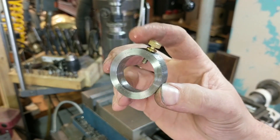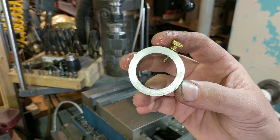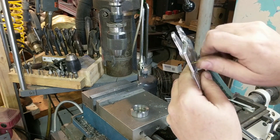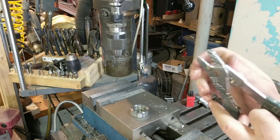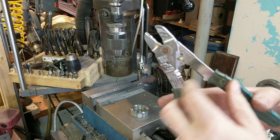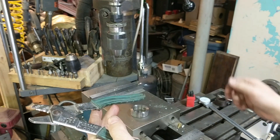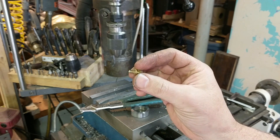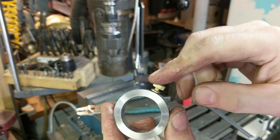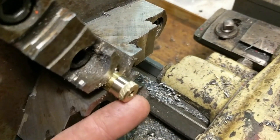Voilà. I want to minimize the protrusion of the screw head, so I'll use my electrical pliers to cut off about six threads off the end. These pliers have a screw cutter built in — I thread this into the one tapped 8-32, look at the protrusion until it has six threads, then just clip it and screw it out. I'll touch this to the sander to clean up the end. Now I screw it almost all the way in to minimize how far it sticks out. I'm also making a replacement knurled nut tapped 12-24 to hold the handle on so I can remove it easily, then I'll part it off.